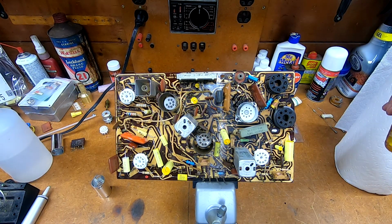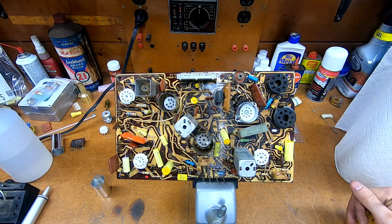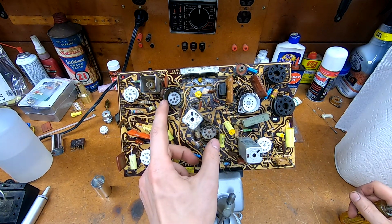Okay, we've moved forward in time. Quite a bit, actually. It took me a while to get everything carefully sorted through. When I went through replacing all the resistors, I tested the originals in circuit before I pulled them out, and I tested every last new one to verify value before they went onto the board, just to make sure I don't really screw something up. But yeah, that all went relatively smoothly. I got all the new tube sockets installed. These shields here were very easy to remove.